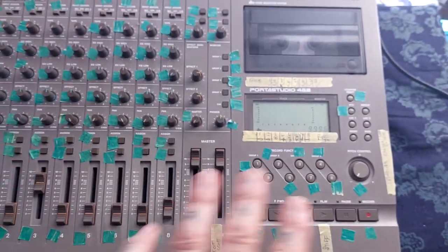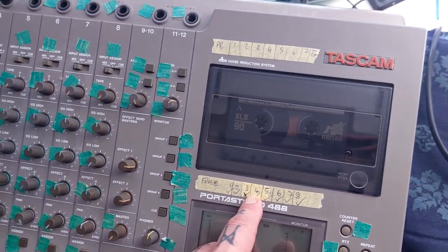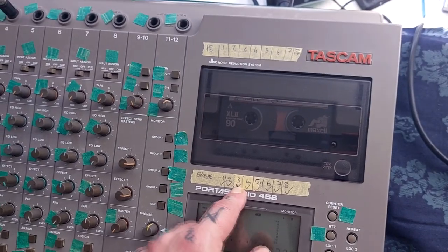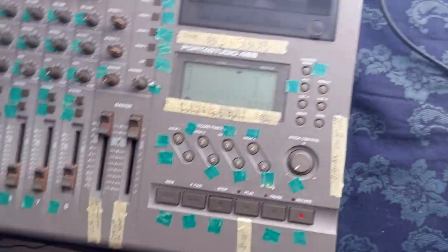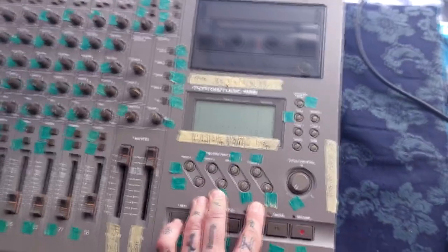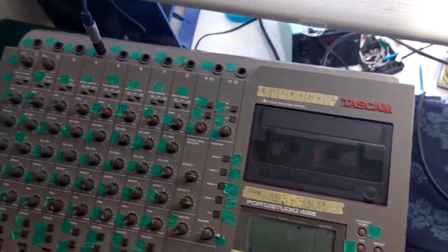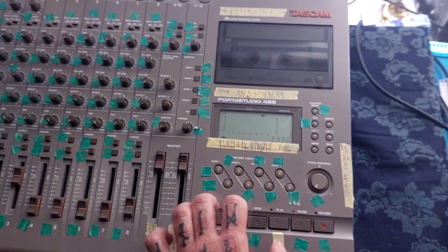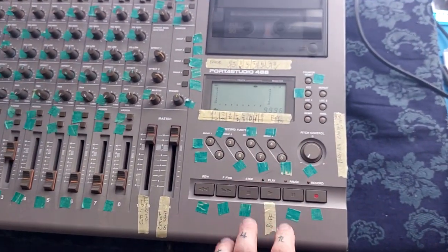Is there a broken cable going to the third segment of the erase head? I can fix that while I'm in there fixing the button and the faders. It may be that the unit cutting out depending on where you push on it is partly because I've only got about three out of ten or eleven screws holding the two halves of the case together. If all the screws were in it might be more stable. I'll have a look around this area and see if anything's loose.